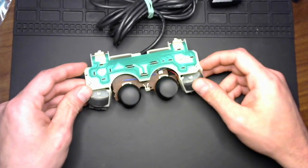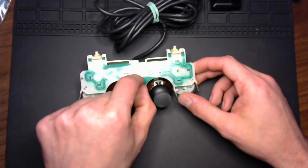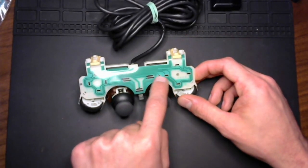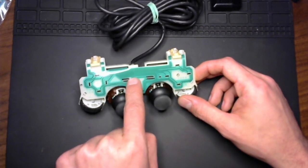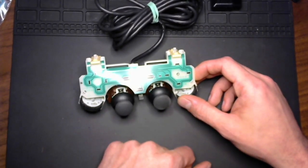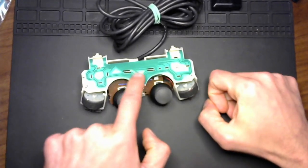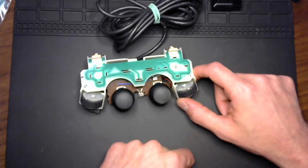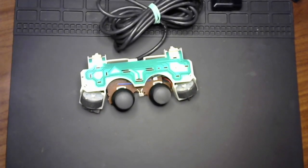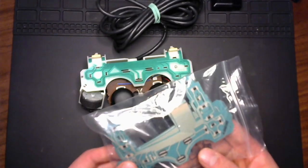And that means that we're going to have to replace this thing. There is no repairing this ribbon cable. These little pads, there's just nothing that you can really do for it. You got to replace it. And thankfully, China in general is still making these flex ribbon cables here. So you can get them from AliExpress. In this case, they're about 30 cents a piece.